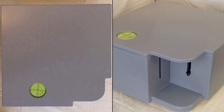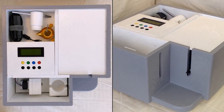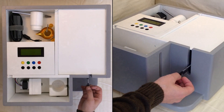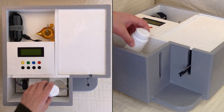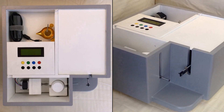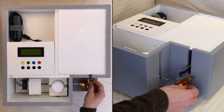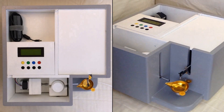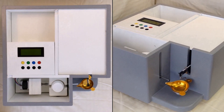To prepare Psyrad for service, make sure that Psyrad is standing on a solid straight surface. Lift off the lid and move the beam from its rest position to its working position. Place the powder trickler in its holder and firmly connect the feeding pipe to the coupling. Hook up the pan to the beam.